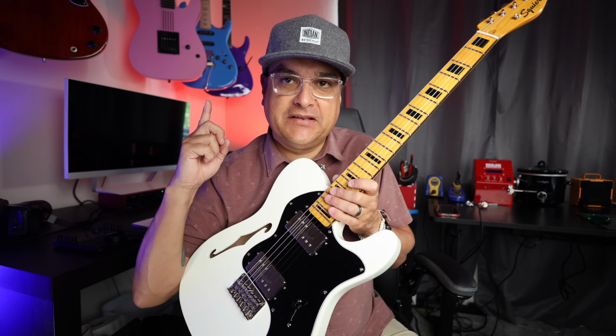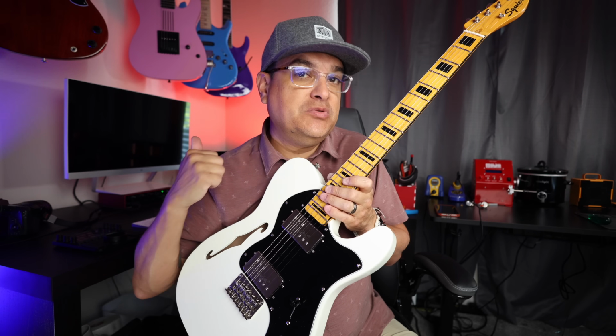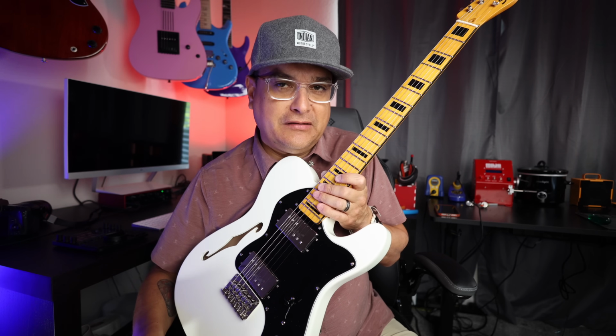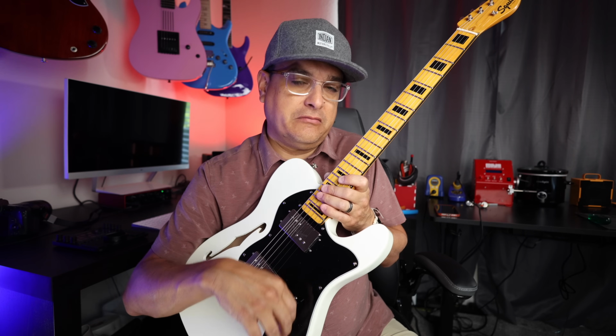You take that PRS up there, the Fiore, it's got a humbucker and two single coils. So what they've done at PRS is split the difference with a 330K pot. Personally, I put 500Ks in a single hum, and then I do it differently. We do a different tone circuit for the bridge versus the other two pickups, which to me works really well.